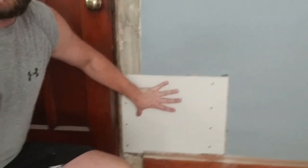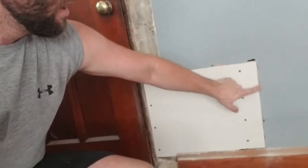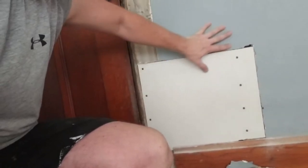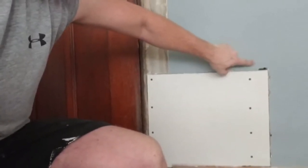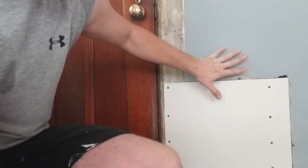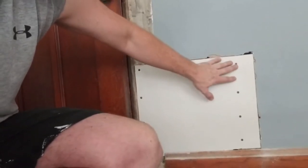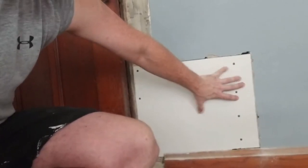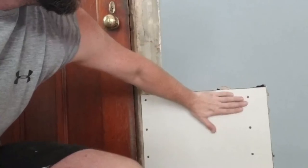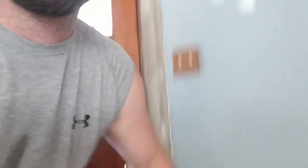You can see the skim coat crumbled around the edge of the cutout, so I'm going to seal all this up with drywall compound. The challenge here is depth, because the way it's built is not consistent — the depth between the stud face and the face of the plaster can be anywhere from half an inch to three quarters of an inch, sometimes even more. This is half-inch drywall, so I had to add shims on the studs so when I screw this in it sits flush — no bump or ridge. I had to put in eighth-inch shims because this is about five-eighths deep.